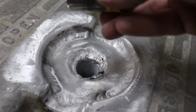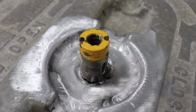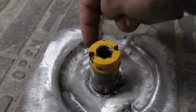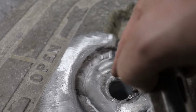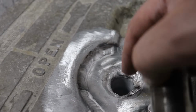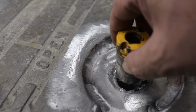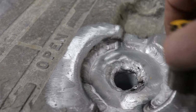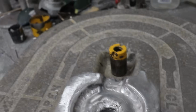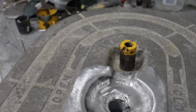And then what I might do is, well, I'm going to have to find out a way. I need to build this up around here. Maybe I can cut a plug for the inside of that as a guide and stuff it in there, and then just use my pilot bit. But I'll basically build this up even, and then I'll come back in and I'll cut down on it, and that'll leave me a little shoulder in there for the sealing gland to press into.